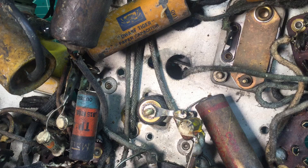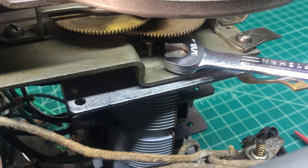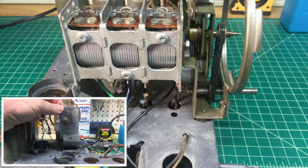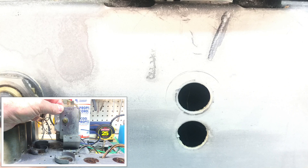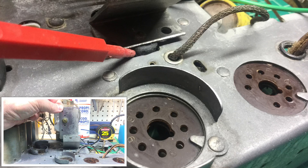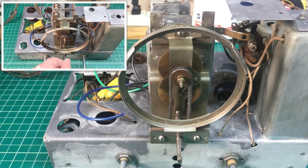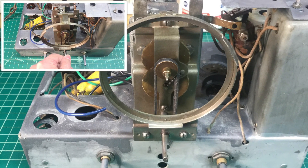This thing went back together really well — it was simple. You just got the three posts and got everything back attached, and it's looking good. In the picture-in-picture, you can see the stability of the tuning condenser; before, it would bottom out metal to metal due to the dry rotted washers. Here I'm tuning through the band, demoing the new drive belt, which turned out well.